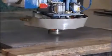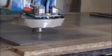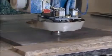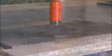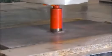They use this precision grinder to taper the sink bottom from the center out so that liquid will flow down into a drain in the middle. They change the tooling and punch out a drain hole in the center. A constant flow of water keeps the cutter cool and the dust down.